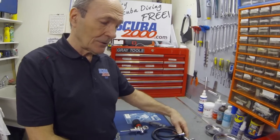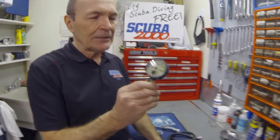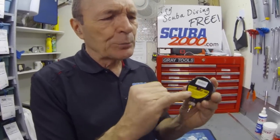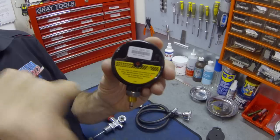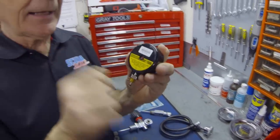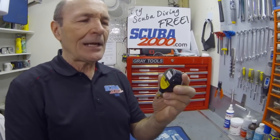This is 2014. Let's look at a modern gauge made of plastic — hard plastic case, nice clear face. It doesn't come apart; there's no ring and you can't open this case. Same Bourdon tube inside with thin brass. Now if this Bourdon tube, the mechanism inside, leaks or breaks, air pressure builds up inside — potentially, if enough pressure builds up, it could explode and send pieces of plastic flying. To prevent that, they've put a pressure relief plug in the back. It says right on here: do not block the pressure relief plug. So if pressure builds up, that little plug comes flying out and the case doesn't blow apart — nobody gets hurt.